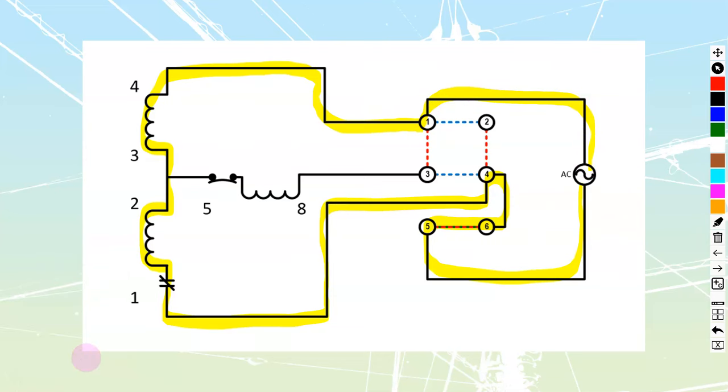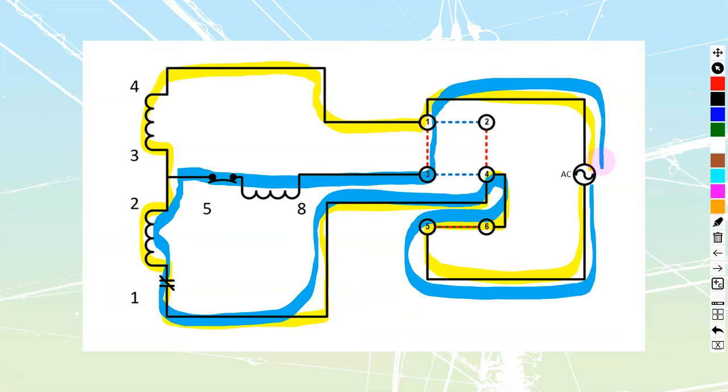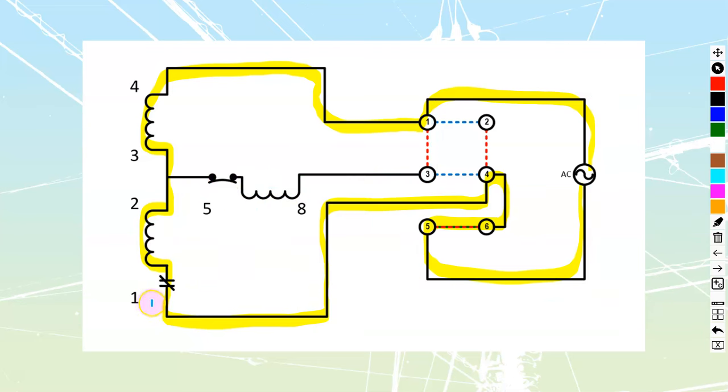Following through with the forward start: AC line is taken through terminals 5-6, which kills all power to the motor when open. When 5-6 closes, we have a path for main current through the run windings. For a forward start, the start current travels down through and into terminal 5, out of 8, and back to supply. All currents — yellow and blue — are traveling through the overload on the motor. When the centrifugal switch senses we're up to speed, it pops and we're just on run current.